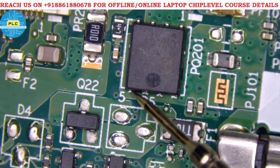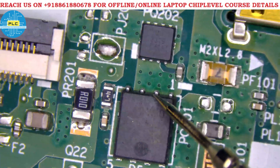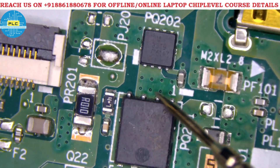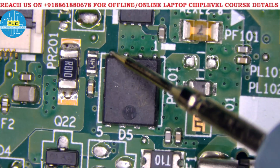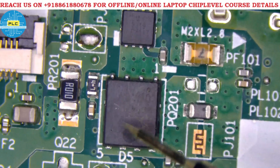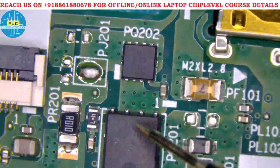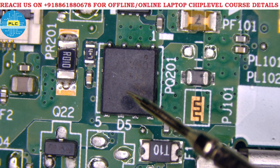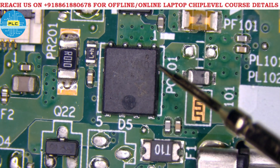For beginners: four pins connected to each other is the drain. Three pins connected together with one separate — the separated one is the gate and the others are the source. Once the first MOSFET gets the appropriate gate voltage, it will pass from drain to source. Whether it is P-channel or N-channel — don't be confused. Check the number on the component online.